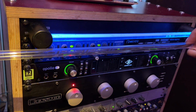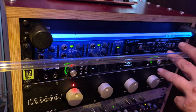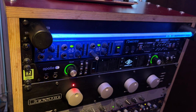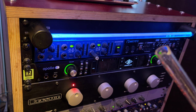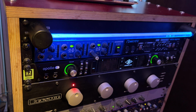The beauty of using tubing, of course, is I have an escape cavity for the wires. The 4 wires required to drive the LEDs are going to run on one side through this housing, which is going to be empty because there'll be no printed circuit board in it any longer, and out to the back where it's going to terminate with the light microcontroller. I've already started, if you can see that, filing a clearance cavity for the wires to exit, so they'll still be undamaged and not misplaced when I'm swiveling the acrylic rod. Let me show you how I can connect the extrusion.